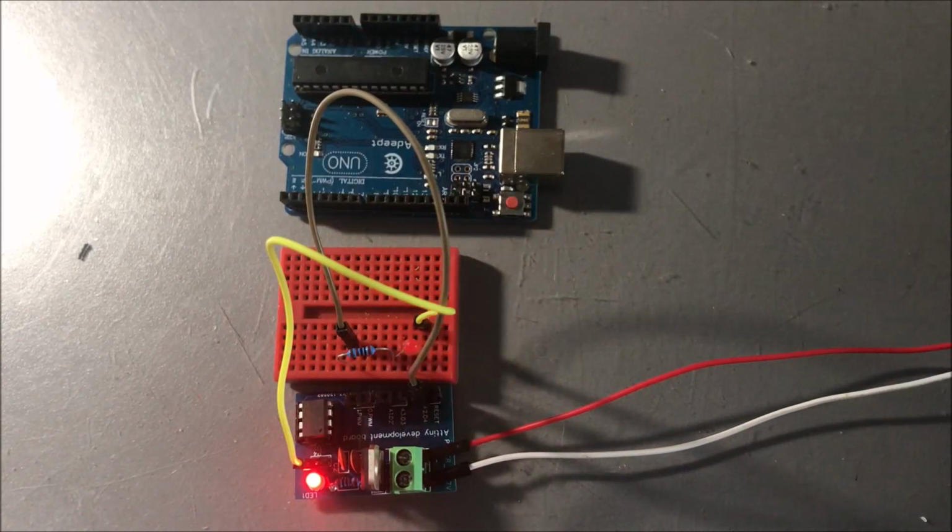And now I can very easily miniaturize my Arduino projects if I need only 4 or 5 digital pins. As you can see, the circuit is very small. The ATtiny is very easy to program with Arduino as ISP, and you can miniaturize your projects with it.